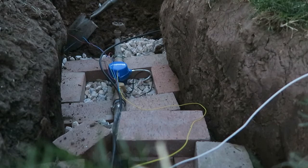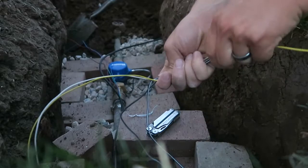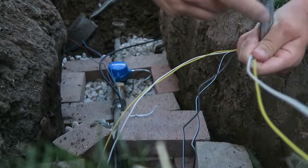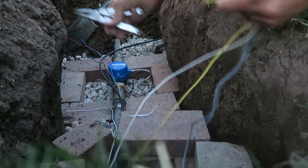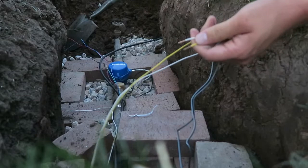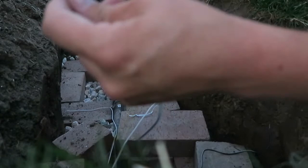Better wire this up before it gets dark. We've got two wires for this box, so I'm going to put these about the same length. I'm going to cut here, cut here, cut here. I'm going to crimp these here. Now I've got these wire nuts — it's important to make sure you line up the tips rather than the insulation, so that they go in the end of that wire nut together.